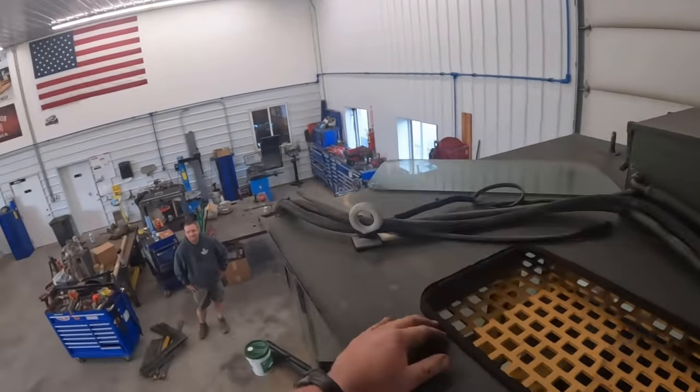I know that one won't chrome, this other one. These probably will re-chrome. It's getting expensive to have it done. I got a company that does it. I may price out some new rod and see how much that is. I do have a mill. I've done it in the past. We can cut some threads and weld some new ends on. I'm going to do some pricing both ways, but if you guys want to see that kind of stuff, let me know in the comments below.